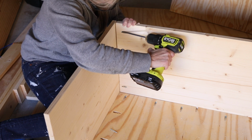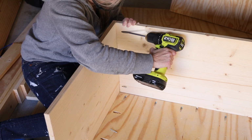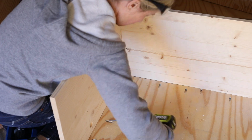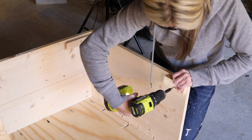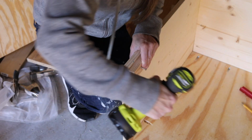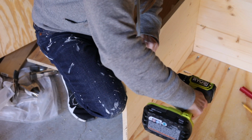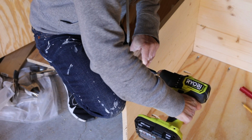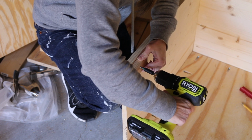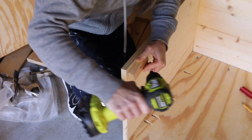You can make your side pieces as long as you want. These are about 2 feet long each. Since I didn't have enough 3/4 inch thick plywood, I used 1/4 inch thick plywood for the front. It's pretty flimsy, which is okay since this isn't going to bear any weight, but it also wasn't wide enough to drill directly into the sides. So I needed to add some scrap pieces of 1x2 board around the perimeter so I would have something to attach the front panel to.